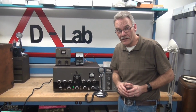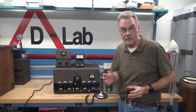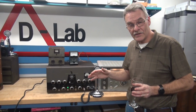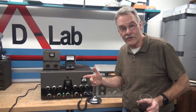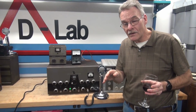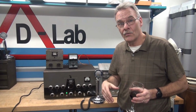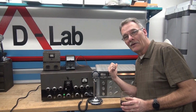Hey everybody, it's Terry, and as you know, I'm a ham radio operator, and I've had some of you writing in and saying, hey, I want to get into classic AM. So I want to run a transmitter and a receiver. So how do I do that without damaging these devices and get them on the air and sound good like all those other guys? Well, I'm going to show you in some simple steps how to set this up using a Dow Key Relay, or as we call it, a TR switch, with muting so that when you turn on this monster, it doesn't blow that one up.